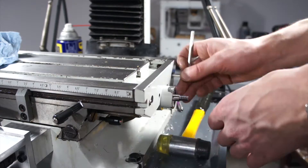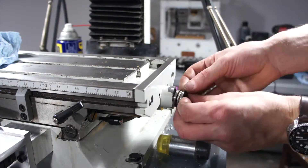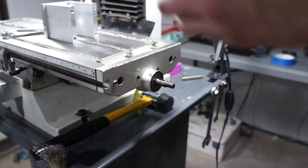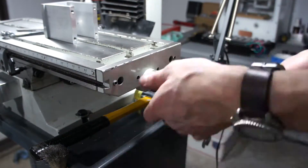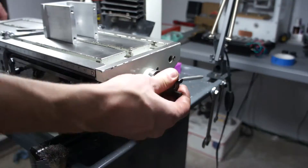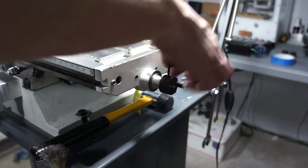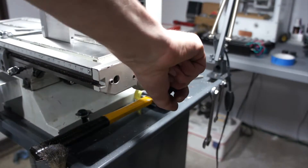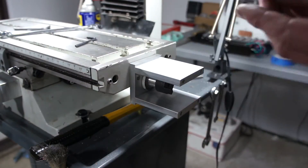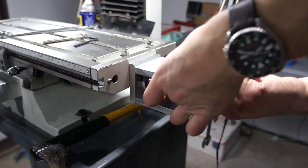When I had the end plate off I took it to the drill and drilled the holes and tapped them for the little stepper mounting plate, which is the next part we're going to put on. Thrust washers go in here and there's all kinds of finagling to do with thrust washers which slowed my progress, but you can see I took a little spider coupler, tapped it to the same pitch as the lead screw, and there's a little collar there that helps set the backlash. I still need to futz with the other side to remove the hand wheel while keeping everything constrained and putting enough preload onto all the thrust bearings — that's something I'm working on in the upcoming week.